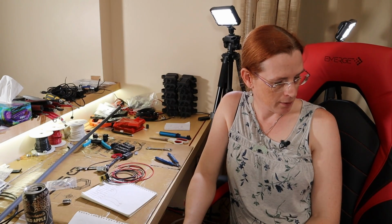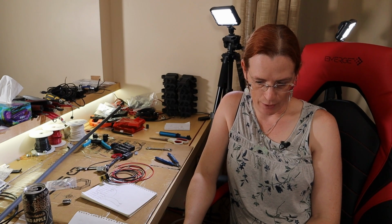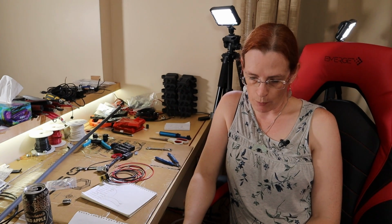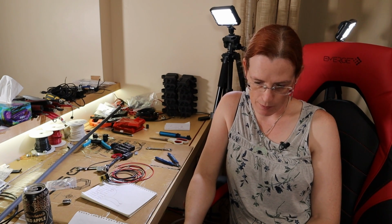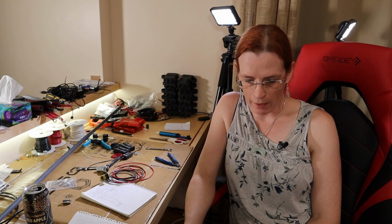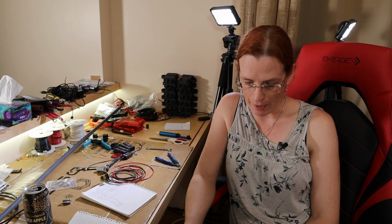The takeaway is, I've got the diode in the wrong place, or rather, I've got the capacitor in the wrong place relative to the diode. Mm-hmm. I didn't use a pre-charge resistor. I didn't think I was going to need it. I do, and that was what was triggering the overcurrent. Yes. The capacitor was smoked by the BMS cutting off the power, causing a big back EMF pulse, I'm sure of it, yeah.